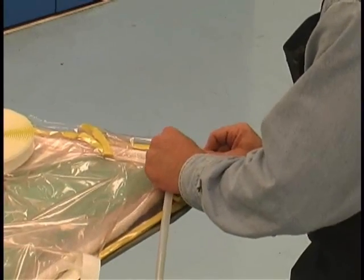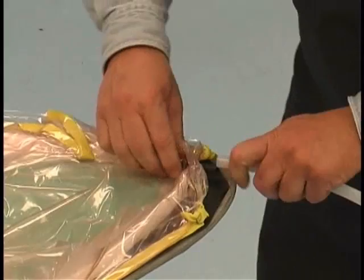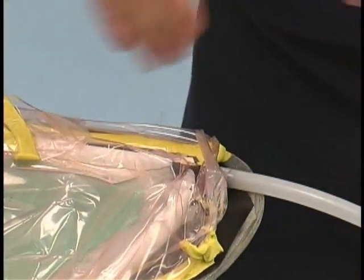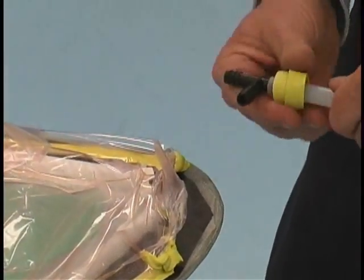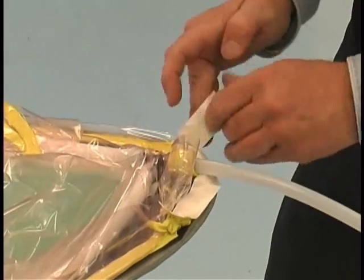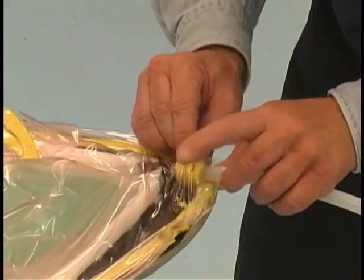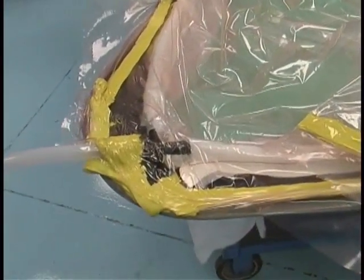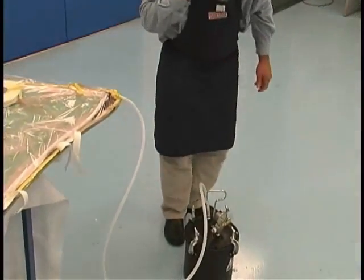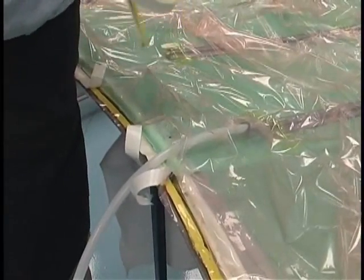Here we insert a polyethylene fitting into the spiral wrap and attach an external polyethylene tube to provide a vacuum source. The external tube is then placed onto the RB451 vacuum reservoir, to provide vacuum and containment for any excess resin that may get into the peripheral vacuum channel. Other solid tubes are attached to the Omega flow lines and then sealed under the vacuum bag.